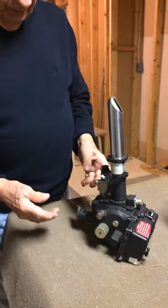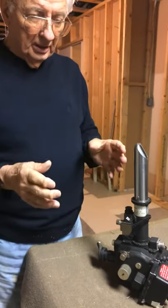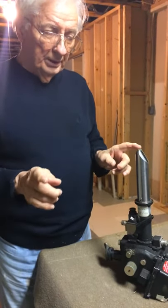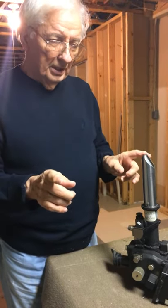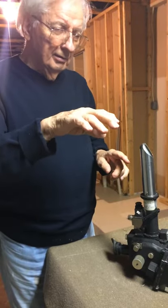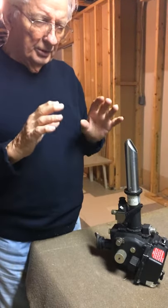Typically, you ran a shot for two minutes. So if you computed a fix for 10 o'clock, you would start your sextant at one minute prior — so one minute before and one minute after the time of the shot, meaning the average period of time. The star or the aircraft would wiggle around, and you constantly played with this knob to keep the star centered in your field of vision for that two-minute period.